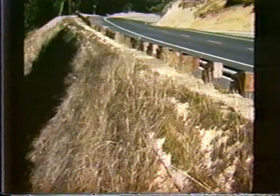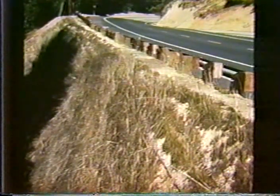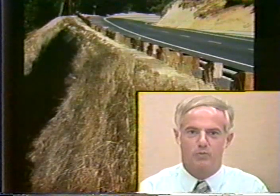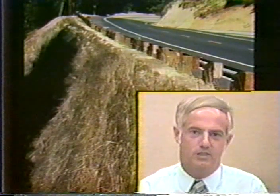And then to maintain stability of the front face, chicken wire was used to maintain the temporary slope of 1/2 to 1, or hold it at 1/2 to 1 until grasses grew and reinforced it with natural roots. And this is what the completed embankment looked like. So this is a tire sidewall reinforced embankment, a rather unique application. Of course,